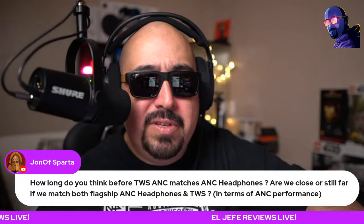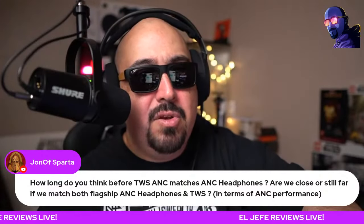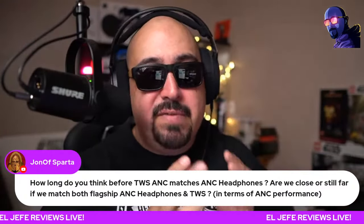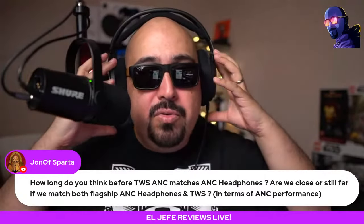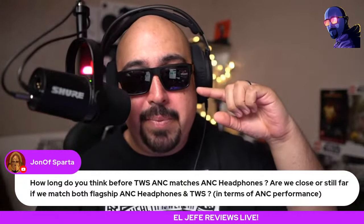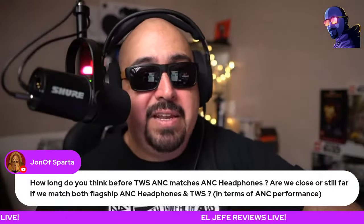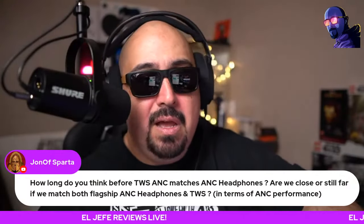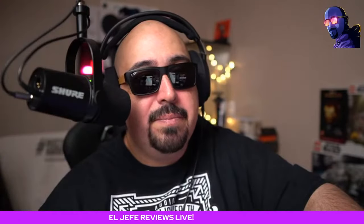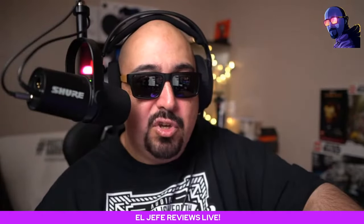It says, how long do you think before TWS ANC matches ANC headphones? Are we close or still far to match both? Well, see, here's the thing. That's a physical thing. So I don't expect noise canceling earbuds to ever really be as good as noise canceling headphones. Noise canceling headphones have the advantage of not only the electronic noise cancellation, but also using sound deadening and padding over your physical ears themselves to further reduce noise. So instead of just being an ear tip or foam or whatever you're using to plug your ear hole, a headphone is going all the way around your ear. So that's a physical advantage. This is why I prefer noise canceling headphones to noise canceling earbuds. I think they can only make that electronic portion of it so strong before it becomes uncomfortable for people. So that's something to think about. They can get pretty good at it, but I think they can only do so much based on that.